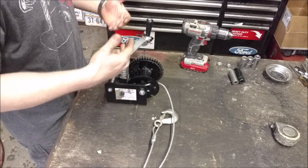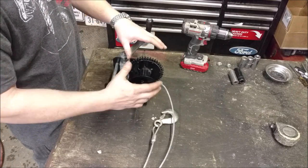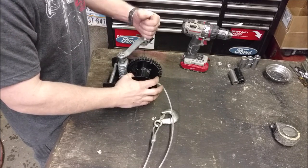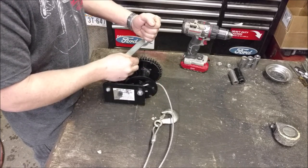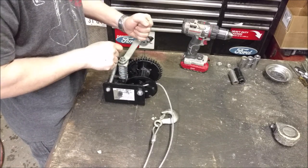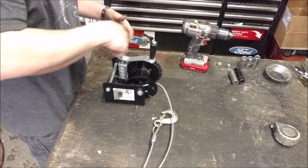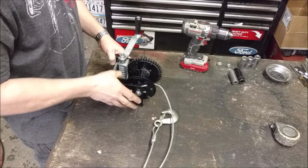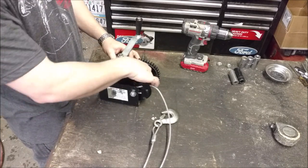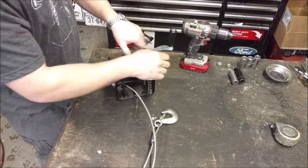The other reason is that inline gear winches don't actually self-brake. Once you lift a load, if you're not holding the handle and you let it go, it will just whip around and let the load free-spool out. The worm drive is better for lifting applications because the worm will never allow it to move — it's self-braking.